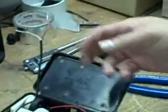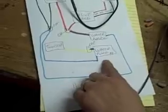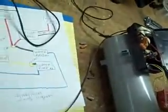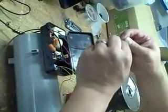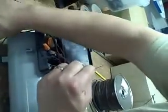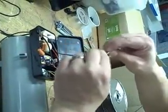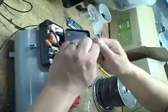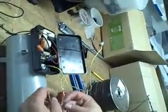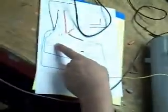Okay, so now actually on my little diagram here, I use for water pump 2 the blue and the brown, but actually coming out of this, it's red and white, which again, not a big deal. It doesn't matter which side you use, okay, but you're basically going to take one side and go to the red, all right, or in the previous case it would have gone to the brown, which is the positive. Okay, the brown is the positive, the red is the positive coming off this extender wire. Same difference. Okay, everybody. And then we're going to take the other end. Okay, you see how it goes to the switch, and then it goes back to our main red cap, which is this one over here.